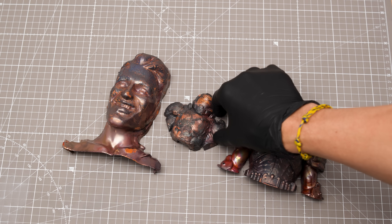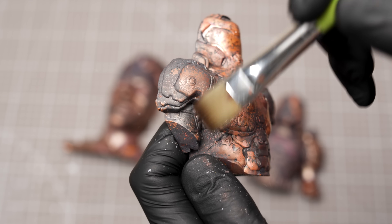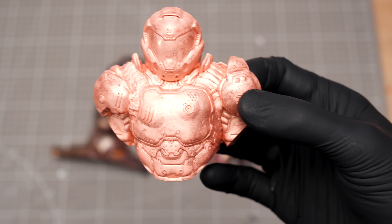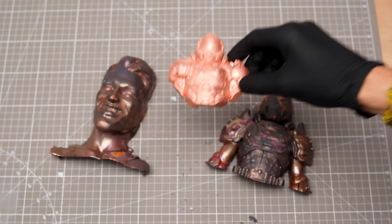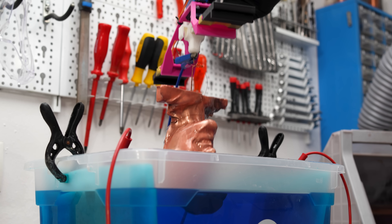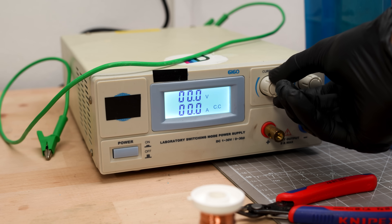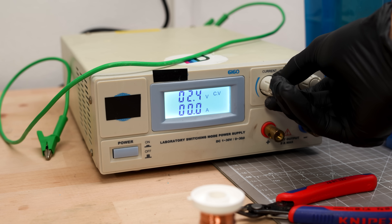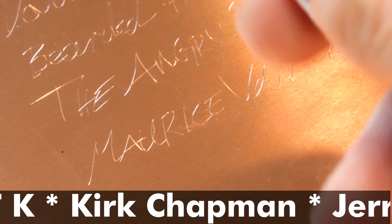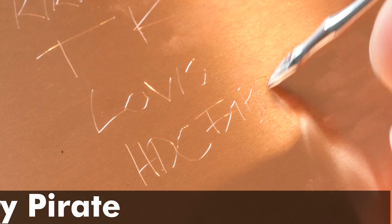To get it shiny again I first have to strip off the oxide layer — just brush it off with a paintbrush. Then reactivate the copper with an acid; I'm using a galvanic activator for that. Next, the parts go back into the electroplating bath, and this step is much quicker now. My copper anodes are pretty much dissolved at this point so I have to add fresh ones. A big thank you to all my channel members — your names will be immortalized on the new anode. May you live on in the prints.